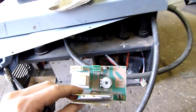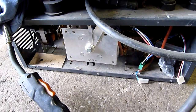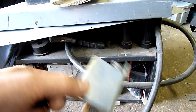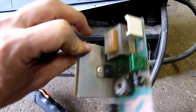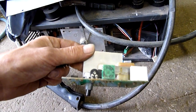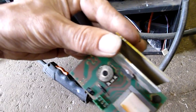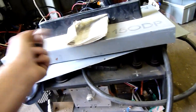I think his kids are about as old as I am, so this thing's probably older than I am. It's an AC and DC mini spool fed MIG welder, so it's really cool. The speed controller in it died - it was just running flat out - so I'm going to rebuild this myself. I'll probably just get a new pot and a new semiconductor. I think it's a FET or something - it's a TIP35C. It's an ST semiconductor and it's got a 1K potentiometer on it which has been desoldered once before, but I don't know if that's the actual problem. That's all that's wrong with it - it's got a new tip and everything. It just needs a good clean up and a run.